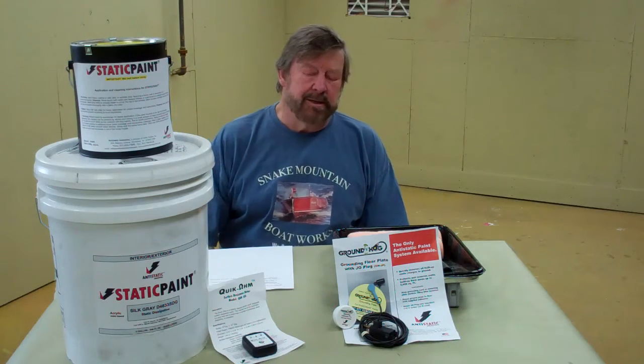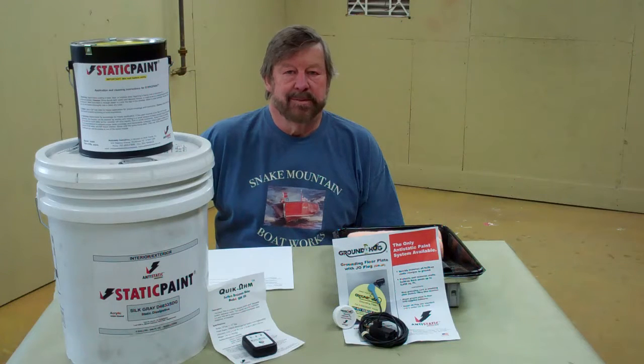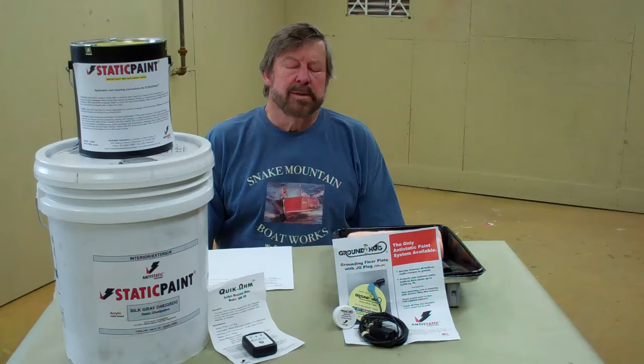One of the issues we've encountered, particularly in the winter, is the presence of static electricity which causes dirt to settle in every varnish job we do. We can get around this, in a sense, by buffing, and we have several videos on our buffing techniques and results. But we do have some customers who prefer the just-varnish look — it's a different shine. This winter, when we had a particular issue keeping the humidity up in here, our challenges around static electricity mounted to the point where we were all really frustrated. We just have not been able to keep dust out of our varnish.